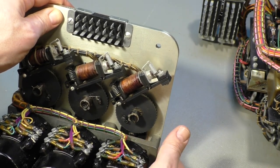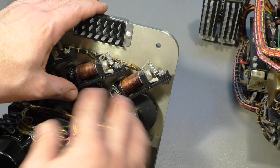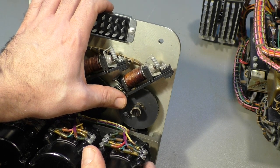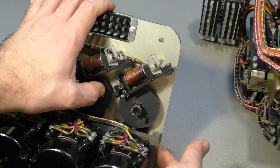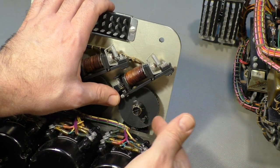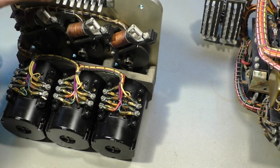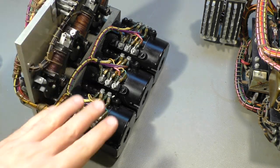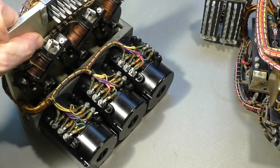There's also a wheel here that limits the adjustment of the propeller to 3%. If you need more, you have to push a button. This relay here will energize, and the wheel here will reset to 0, and then you have another 3% to move until it hits the mechanical limit and you resynchronize it again. Of course, you can also adjust this by hand. So the hand adjustment will be the coarse adjustment, and this is more for the fine tuning and the automatic readjustment during the entire flight.